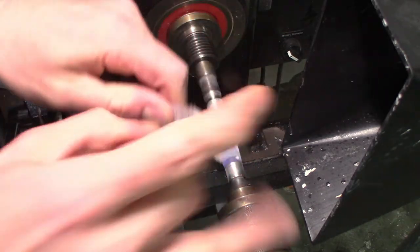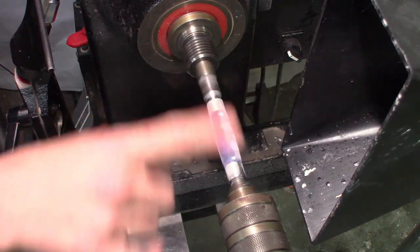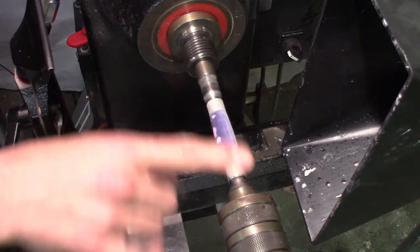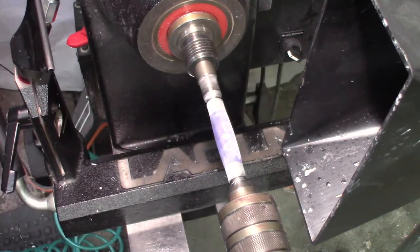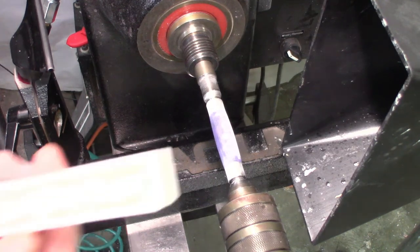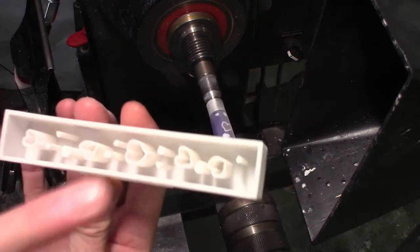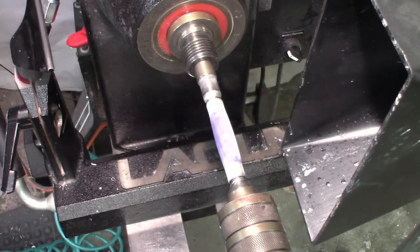One thing I also want to mention: this liquid diamonds is an epoxy, and realistically, on these ones I would prefer waiting, especially since it's not a whole lot of resin. It's not like I poured a brick of blanks. You're only pouring a single blank at a time here, so it's not a ton of resin. I would probably rather wait a week on these to make sure they're fully cured.